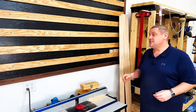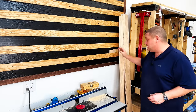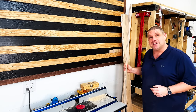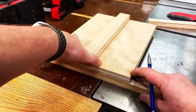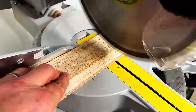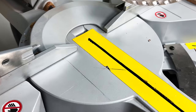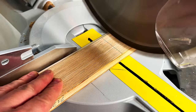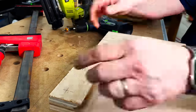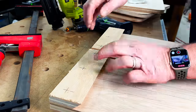One of the best things I did when I made this French cleat wall is I made some extra cleats, so I can just cut off what I need and add it to our clamp rack. I'll take one of my French cleat scraps and mark off exactly what I need, then cut them down to size over at the miter saw. Once those cleats are cut to size I'll add a little bit of wood glue and then nail them to the back of the frame.